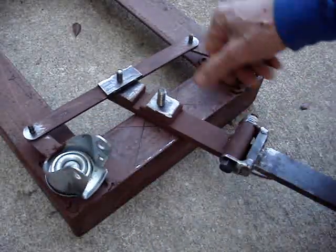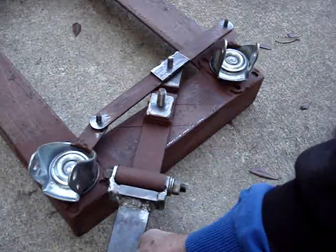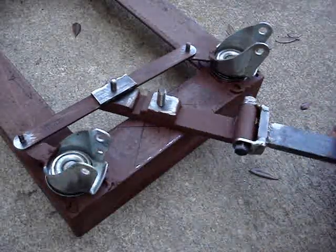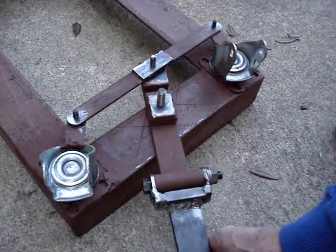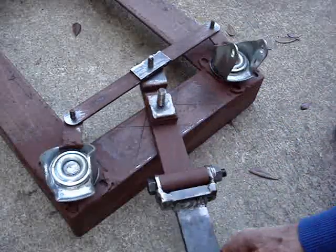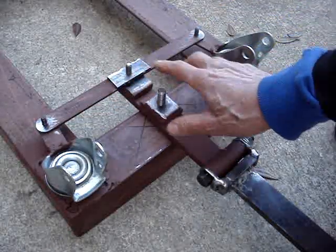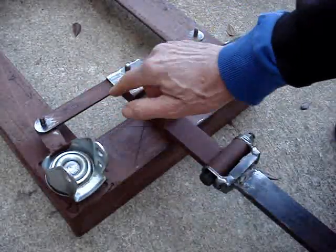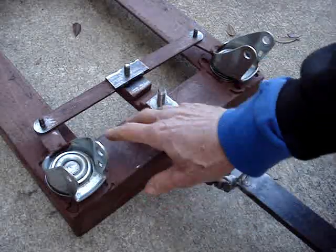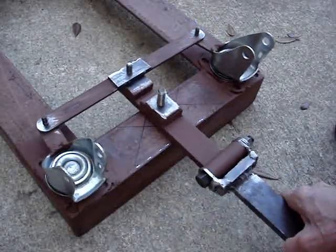This is 5/16 or 3/8 by 2-1/2 — it's adequate for the job, and it's way better than what the factory had. After it's greased it'll no longer squeak. Getting this long straight single-piece arm back on all three studs at the same time is a real trick — it took me about five minutes, and I was worried I'd warped something when I welded the casters down. But it does go on and I didn't have to file out the holes, so that's a big plus.